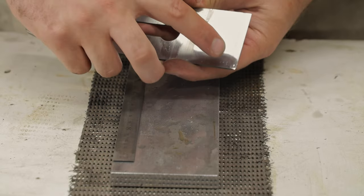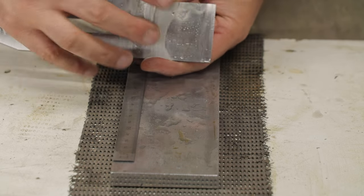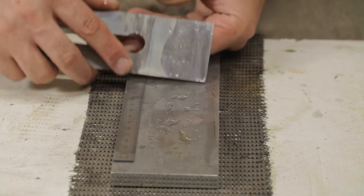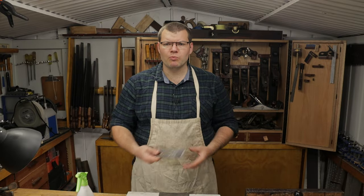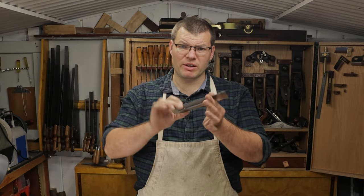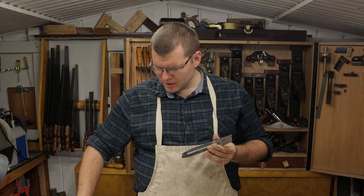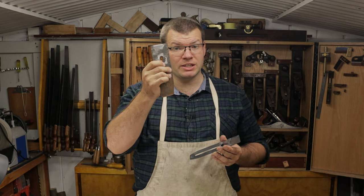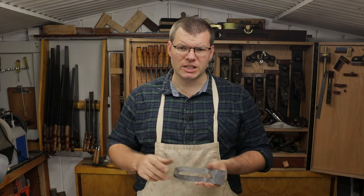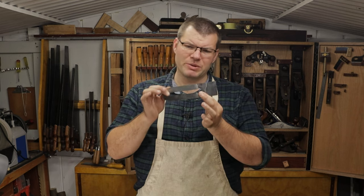And what that results in is what we call a back bevel on the back of the blade. Now, normally this is done on quite a fine stone, but you can work on more aggressive stones and then go finer. These thin blades like you get on the Stanley Bailey can get a little twist in them because they're quite thin — the chip breaker is there to stiffen the blade up. But you don't necessarily have that happen with the much thicker, more modern blades. Those ones are better machined, whereas the thinner ones are just punched out of steel and can sometimes come even brand new with twists in them.